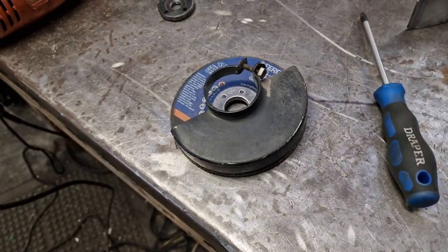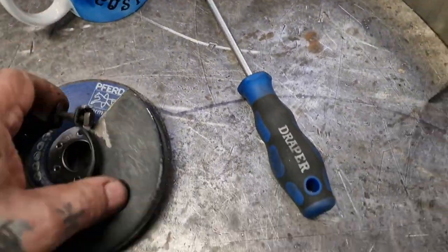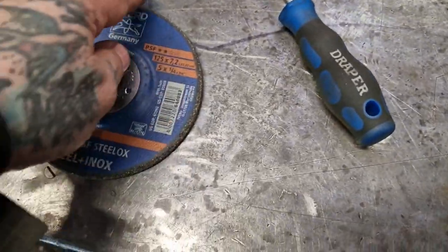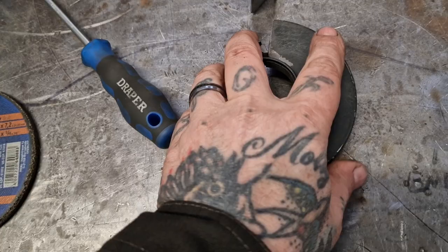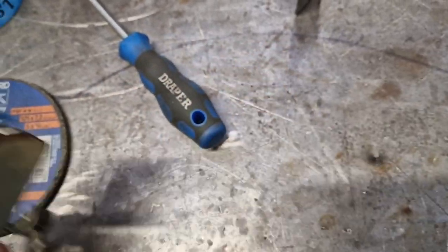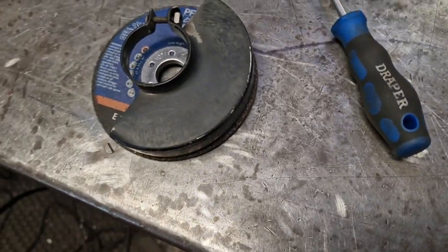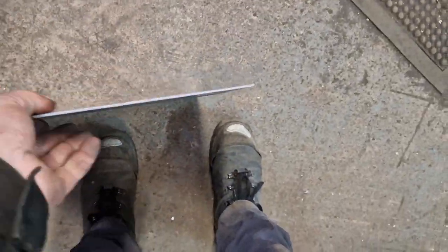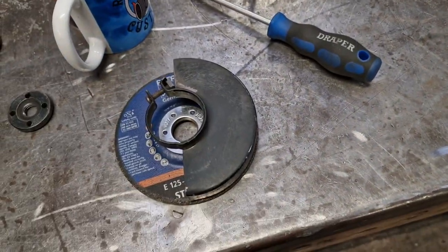I'm not sure the best way of doing it. I can slice that off no problem. Let me cut in this, and then I need to fabricate a strip - the diameter - and weld it on there, and then I need to put an edge on it. I think I'm going to maybe utilize some of this for the edge. Look at my stock pile - there's something like this 1.2 mil to make a curved bit out of. So I'll get that cut off and then we'll look at marking it out.